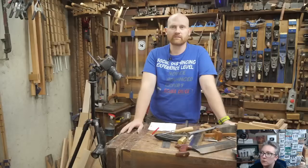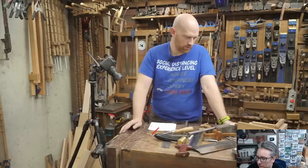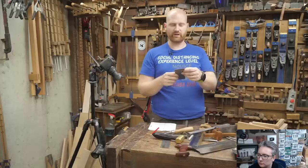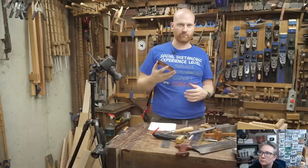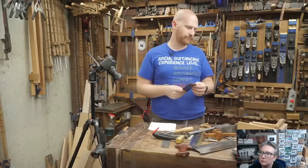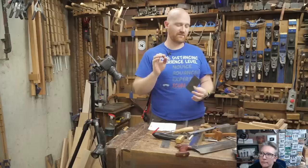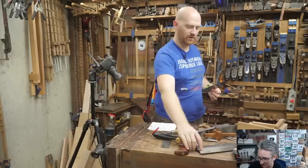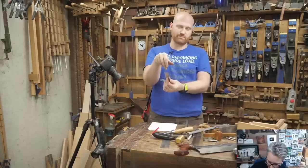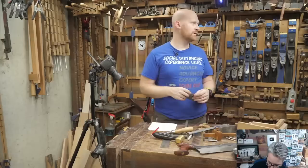Tiny Woodshop wanted to know: does that ruin your card scraper when you used it earlier? No. Using a brass head — no. With the steel head I do get a bit of mushrooming on the back here, but does it ruin it? No, because next time I sharpen it I'm just going to hit it with the file and clean it up, and it's good to go. It wasn't ruined even with the steel hammer — I'll just have to do a little more dressing next time I sharpen it. The trick is finding one that's exactly the same thickness as your saw plate.